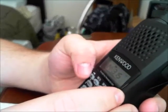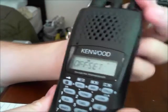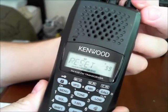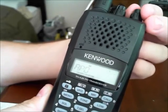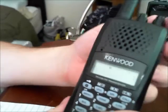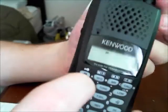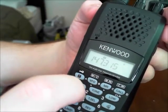For the offset, we're going to go into menu. Menu option 7 is offset. If you're not at menu option 7, you can use the ENC to get to it. Then hit function — you can see it's at 0.6. If you wanted to change it, you turn the ENC knob, and once that's all set, hit function again and then menu to exit.